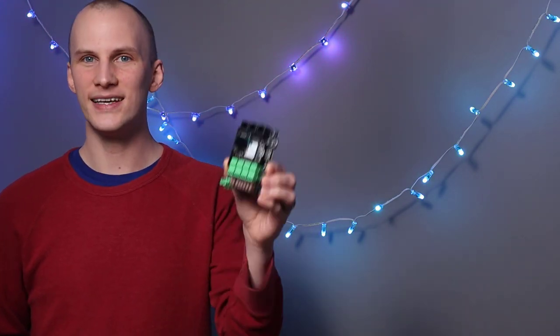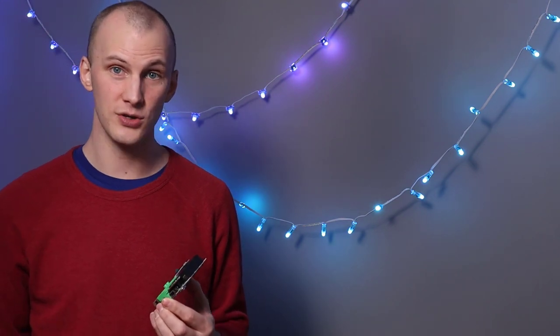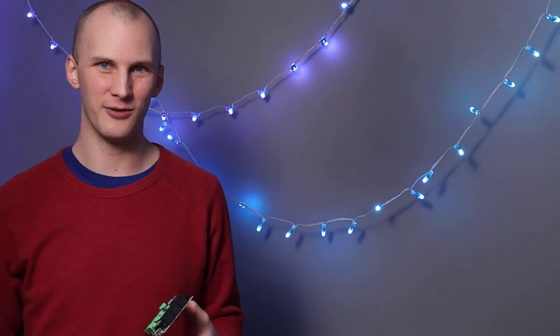And when you're running these, it can be okay to run wireless. Like, I'm not a big fan of running a lot of pixels wirelessly if you're sending that E131 or that ARTNET or DDP data. It can be done, but it's a lot of data. A lot of times people run into issues where things are slowed down, things get behind, you start skipping frames, and you generally have issues with that. Again, on smaller setups, it's not an issue, but as you expand or your neighbor gets a new router at his house, and all of a sudden things aren't working right, whereas the wire pretty much always works right.